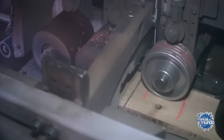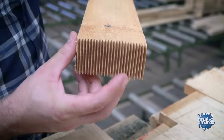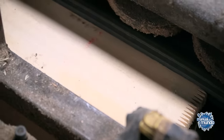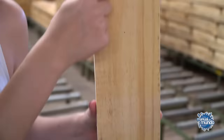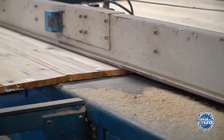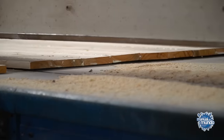These little pieces of wood, now without knots, have to become a single board. To do this, they notch some teeth on the edge of the board, apply white glue and join them together. When it's done, it looks something like this. Then this wood has to be glued once more on the side — this machine applies a strip of special glue, which has to be dried in the microwave. That's what makes sure it stays strong.